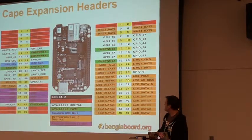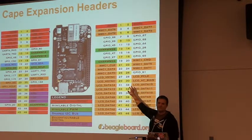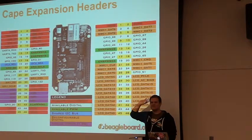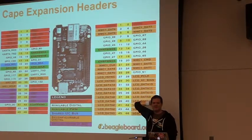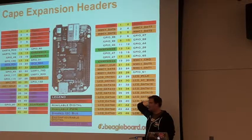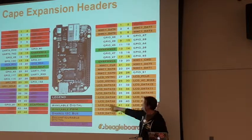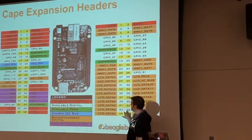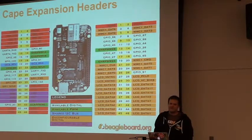This is the default configuration. We essentially use the same pinout as the BeagleBone White. The HDMI interface is what's called a virtual CAPE — 'CAPE' is just a word for daughter board. Arduino had shields, we call them capes, Raspberry Pi calls theirs hats. The HDMI, when turned on, uses these orange pins for audio and the pins over here for video out, so you have to turn off HDMI if you want to reuse those IO pins.